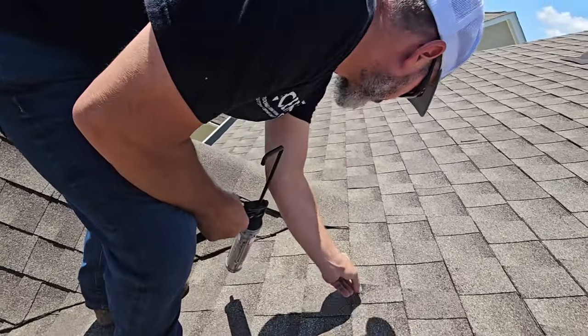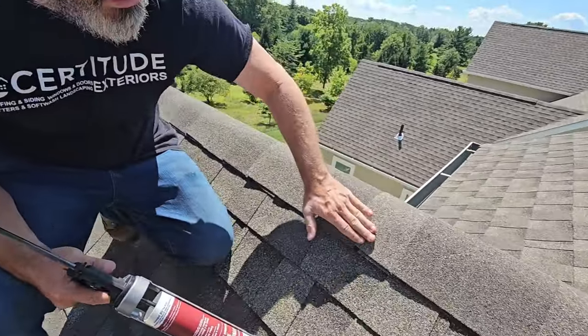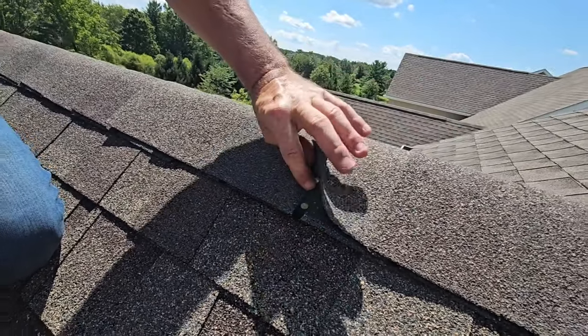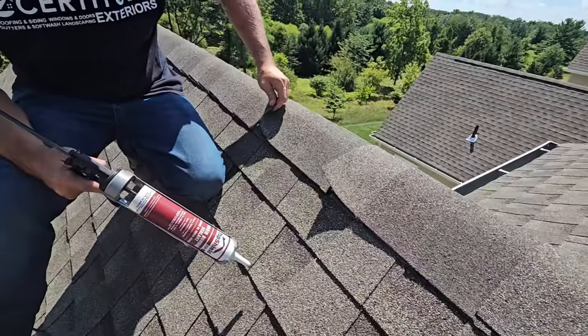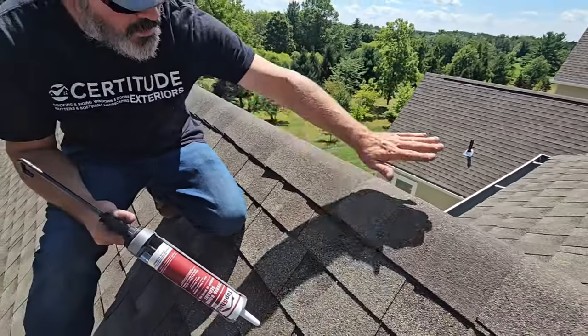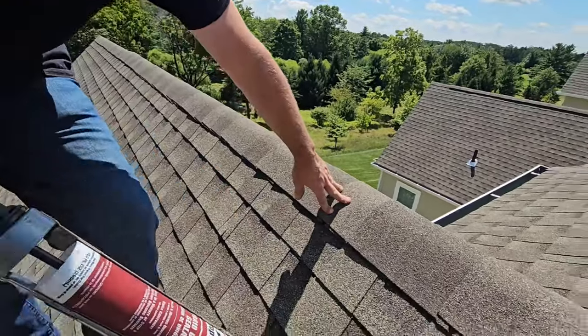We're going to go through this roof. One of the other things is the ridge cap — you see how the shingles are sticking up? All these nails have popped through. I don't know whether they used the smaller nail or why they did this — maybe the plywood's bad in here. The wind can run in through there and cause leaks. It's less likely because it's at the top of the roof with less water volume, but this is not good. We'll nail those down.